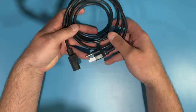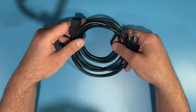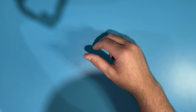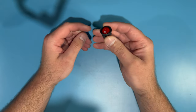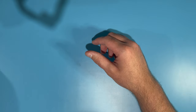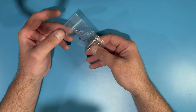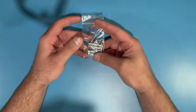Obviously you're going to need a power cord — if you're like me, you've probably got a bunch of these in a junk drawer. Any old computer or printer power cord should be perfectly fine. We're going to need a panel mount illuminated rocker switch — it's small and cheap. And we'll need a panel mount fuse holder. You'll want a fuse — I've got some 3 amp, 250 volt slow blow fuses, which is what you'll often find in classic arcade machine power supplies.